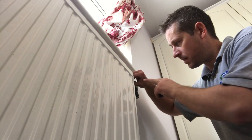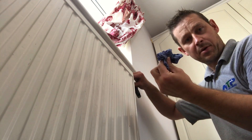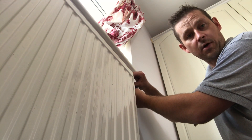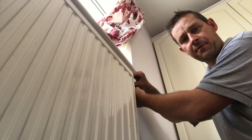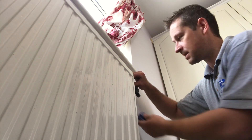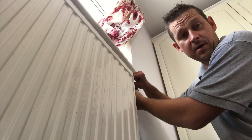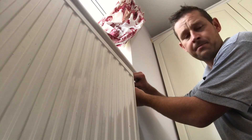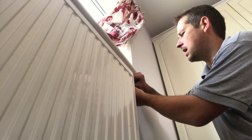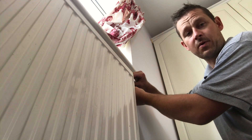It's making a hissing noise and that's just the water coming in. I've got a blue towel to catch any water when it comes out, and I'm ready to turn the blue valve off when that happens. If you find that noise stops and you feel there's no water coming into the system, all that means is that the tank in the loft is just out of water, depending on how big the house is and how quickly it's gone in. So just turn the blue valve off, give it five minutes, let that tank fill back up, and then just try again. It's as simple as that. Go around all the radiators getting all the air out.